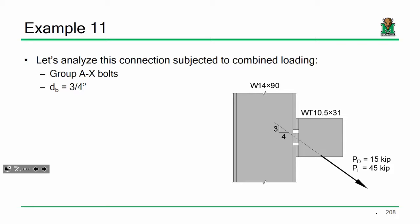And the biggest instance is a beam column, because columns are in compression, and things in compression like to buckle. If you take a column that's already in compression and you add some moment to it, that's more compression on one side, so that makes it worse. So for beam columns, it's not very advantageous. That's why when you look at moment frames in buildings, the columns are bigger for that very reason, because that additional moment doesn't help the column at all.